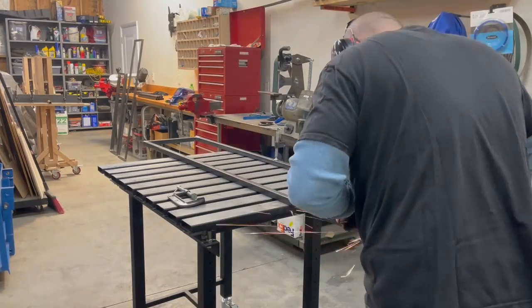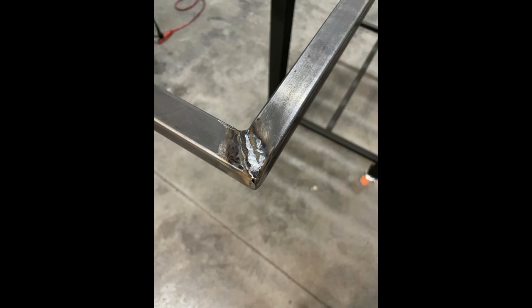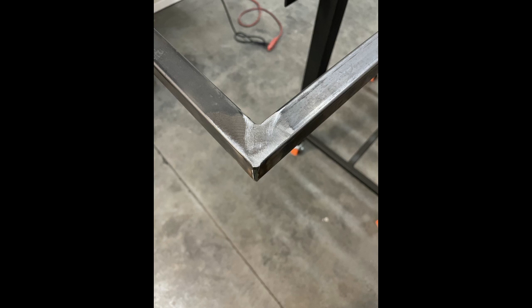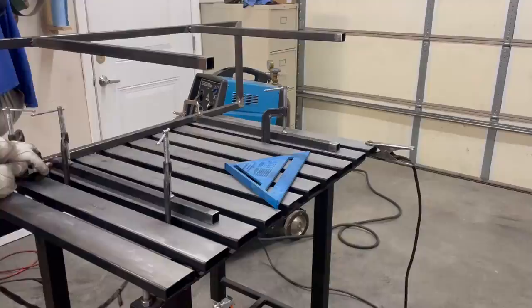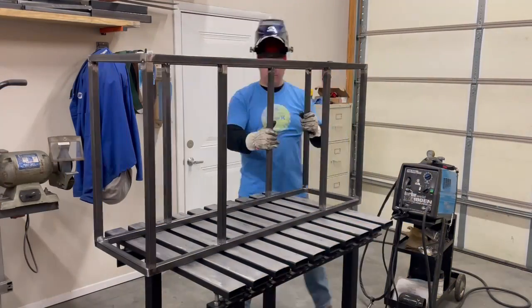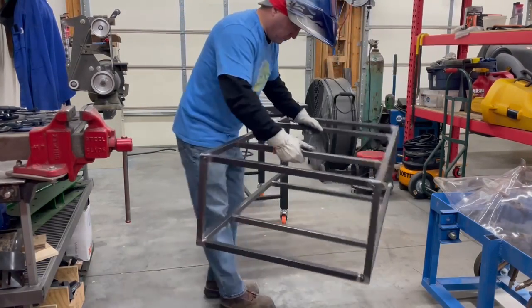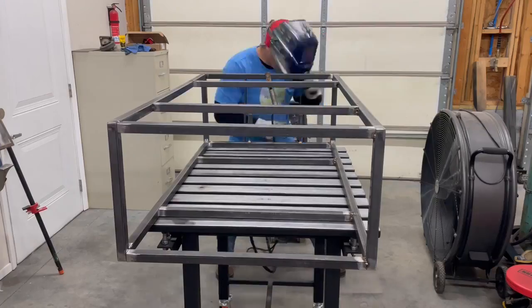You put in that time so your results look better. In just a couple of minutes I have a comparison of what a weld looks like before and after. You can see it's kind of built up with some heat marks — kind of ugly looking — but when you blend it in and spend time on it, this is what it can look like. You don't want to take it to the powder coating place looking like a mess, because it's just going to be a coated mess. Almost done mocking up this frame — getting everything square and clamped down. This looks like the small table, and everything looks good. I put it on the floor to make sure it sits stable and doesn't rock. Looks pretty solid.